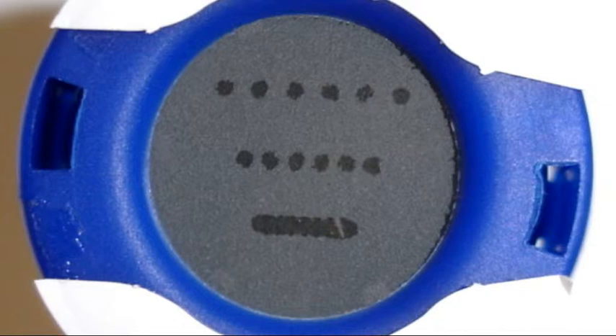The following pictures are examples of tests where oil has been present. The first picture shows dots present on each of the three rows, but none have joined into a continuous line, so the oil concentration level is greater than 0.05 but less than 0.1 mg per cubic metre — still a pass to BS EN 12021. On the second picture, the bottom row of dots has formed a continuous line, but the middle and top rows are still individual dots, so the concentration is greater than 0.1 but less than 0.5 mg per cubic metre — again a pass, but only just, to BS EN 12021.